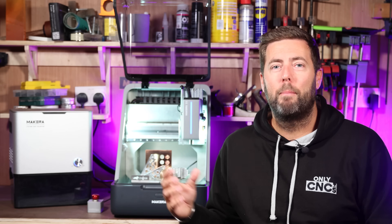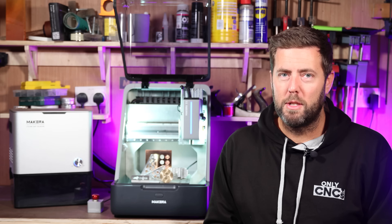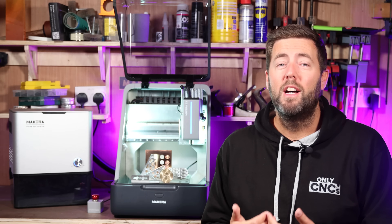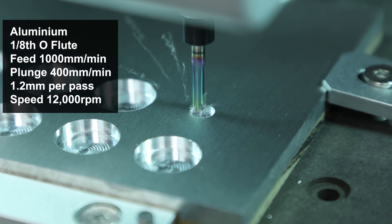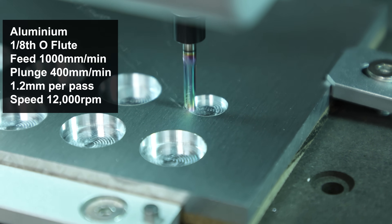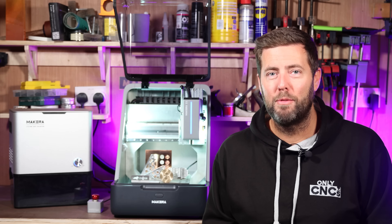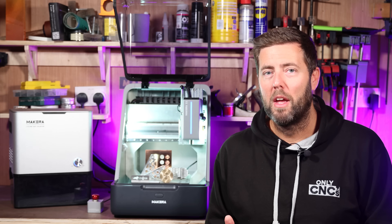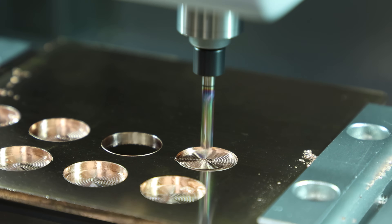When it comes to machining metal — which I know a lot of you are looking at this machine to do — it is worth clarifying about the spindle. Yes, it is a 150-watt spindle, which is lower than most people expect, but it is a brushless motor in a closed-loop system, which means the RPMs can be monitored and adjusted accordingly. For me, doing a review is about pushing the machine further than its recommended settings, and that is actually what I did with machining aluminium. I went as deep as 1.2mm per pass at 1000mm per minute, and it handled it absolutely fine. Yes, slightly slower speeds or shallower cuts would have given cleaner results, but it still machined through at those deeper and higher speeds with the same accuracy. It is a lower-powered spindle, but it can still be pushed to machine softer metals at more than reasonable feeds and speeds.